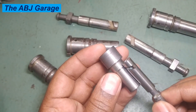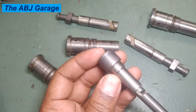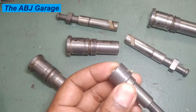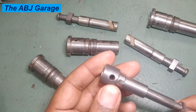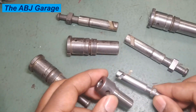This is a pumping unit for a multi-plunger diesel injection pump. When it is inserted and fuel is admitted through the feed port, fuel from the feed pump will be supplied here. When the plunger moves up it exerts pressure and pressurized fuel will be injected out of the injection pump and into the cylinder.